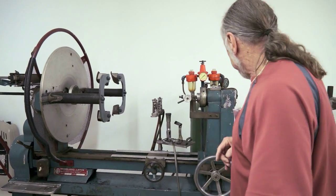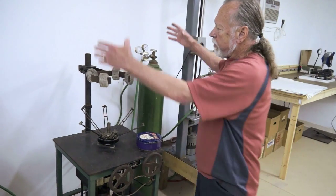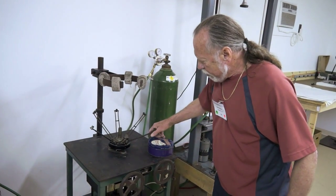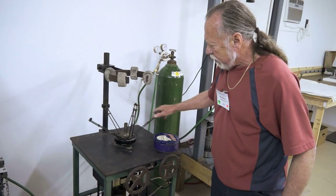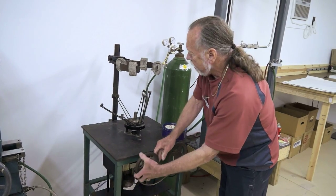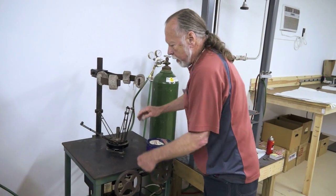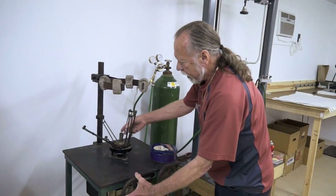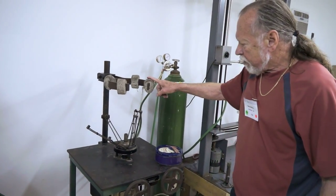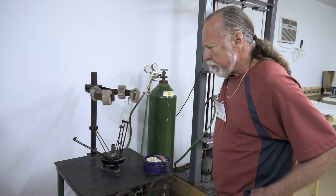And that's generally the best use for this, for welding a new piece of glass onto the end of a tube bulb. This is a vertical lathe, one of the two kinds that we have, and in this lathe, the tube sits up here, and instead of the tube rotating, the gas jets rotate. So when you turn the motor on, this rotates around like this, and you can move the jets up or down. So what you do is you position the glass that you're welding on here, put the tube here, and then you bring the glass up so that it mates with the tube as you apply the heat. This is the one that John Yurkon is using in his experiments up in Michigan.